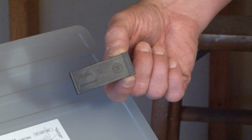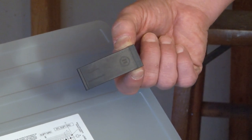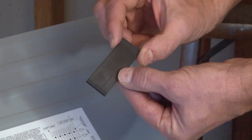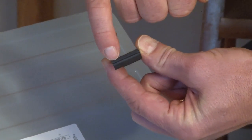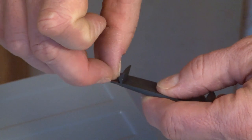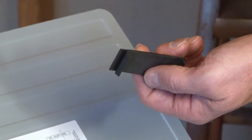Garvin Industries part number BF100U is a universal non-slip breaker filler plate designed to snap in to many of the most common circuit breaker openings in the industry. This particular version that is patent pending is made from non-flammable plastic, has a specific pinch trim opening on one side, and also has a quick, easily removable peel and stick adhesive on the other to prevent the circuit breaker filler plate from sliding down the panel when the cover is removed.